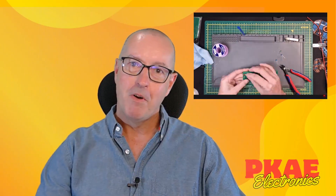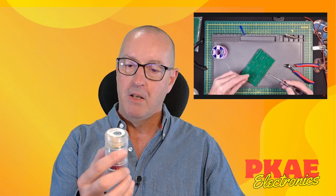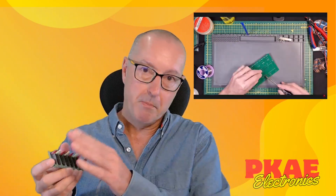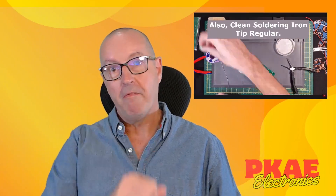A couple of weeks ago I put together a video where I was assembling one of my remote PAVA triggering boards, albeit very fast. It occurred to me that I make a lot of use of these things - they're called jumpers. If you're aware of jumpers you might think it's a bit dull, but stick with this video because there are some uses in here that you might not have thought about. For example, these resistor network boards can be configured through jumpers from one ohm in increments of one ohm right up to 10 mega ohms.